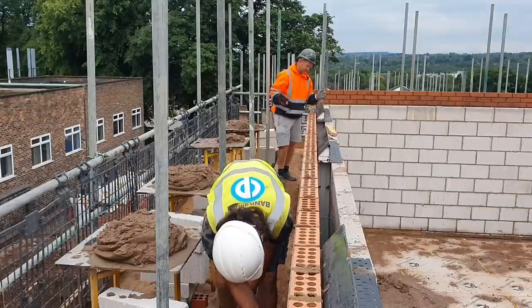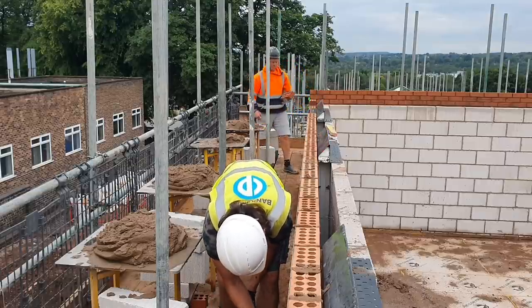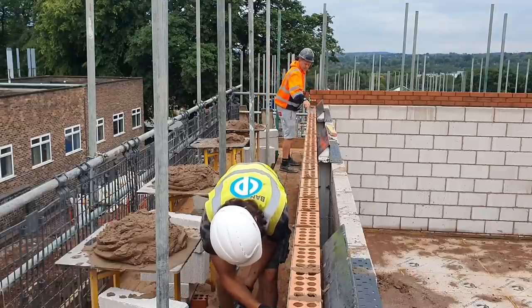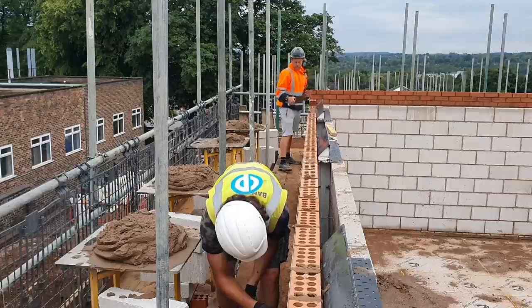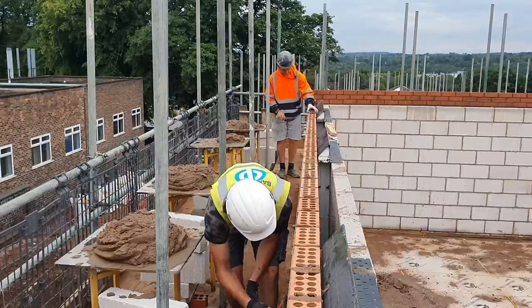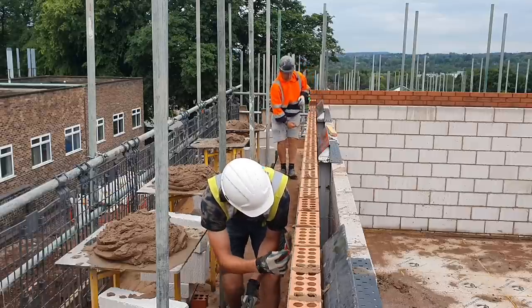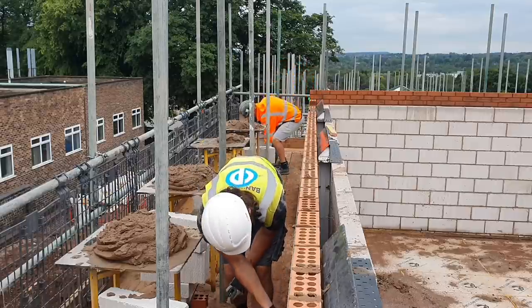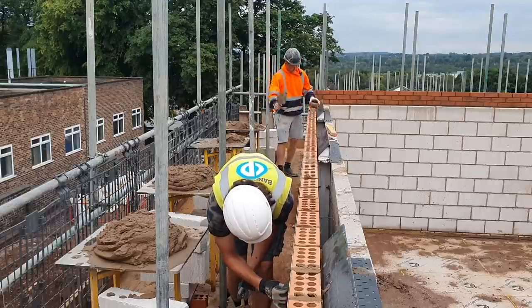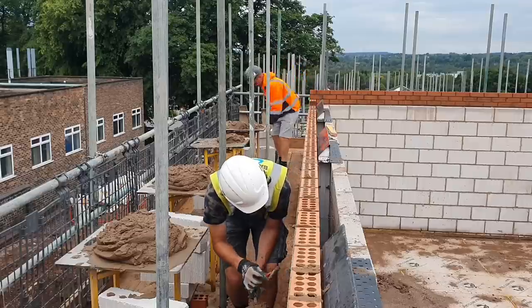Everything just works supremely, like there's no tapping stuff down, bang, bang, bang, trying to get stuff down over the lintels. It's just weird, everything works nice. Don't need to prop these with one brick. Not enough weight to bow them. And then once it's gone off a little bit, I'll go underneath and strike these. Don't particularly strike them when it's wet. Take the main excess off.